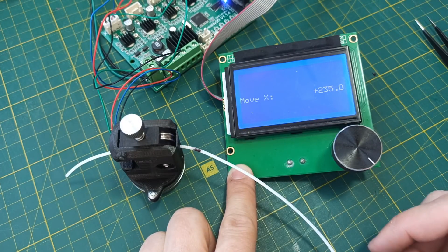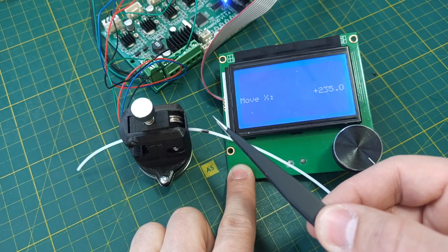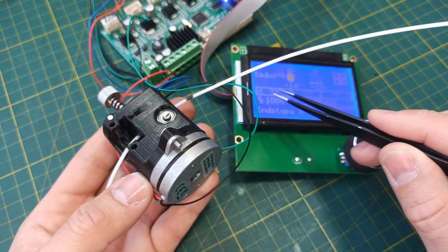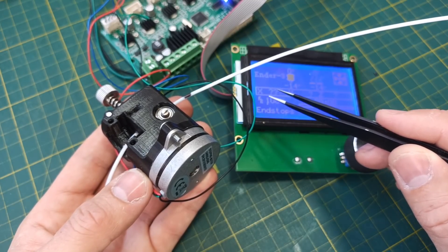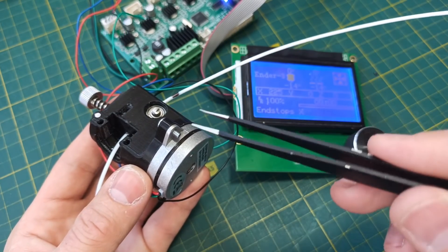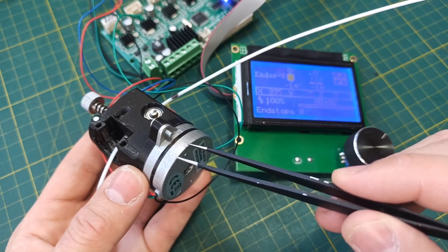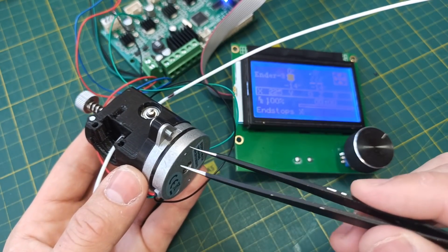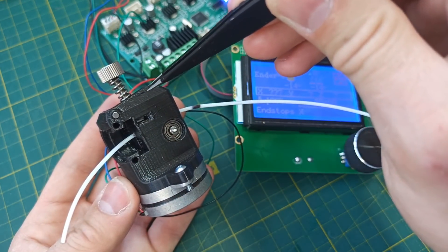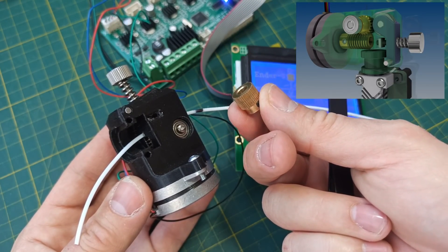We can see that the power is working very well under the filament. But as you can see, instead of 235mm, the movement is 20 times less. In Marlin I currently have 400 steps set. I did not do this accidentally — by increasing the speed of the motor there are problems, because the motor is not meant for fast work. The wheel of the motor plays a role similar to the MK8 drive gear.